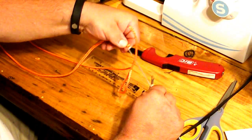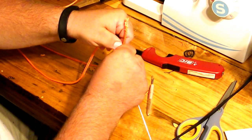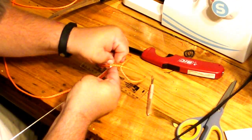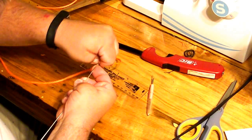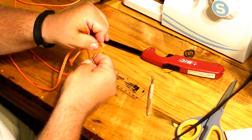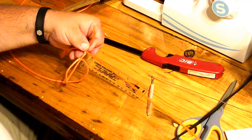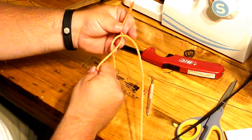After you go through, you'll grab the other end. It's a little thicker because you've already got your Locked Brummel on the other end. So it's going to be just a little more difficult, but it is not as bad as what you might think. Maybe it won't make a liar out of me. Just kind of work that Amsteel, it'll spread apart. There we go. And you take it. Alright, now you just pull all this back through like so. You'll pull it down and lock it, and that is actually a Locked Brummel.